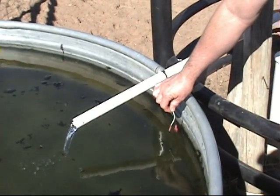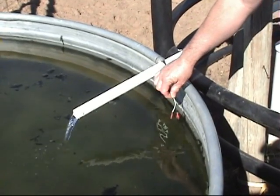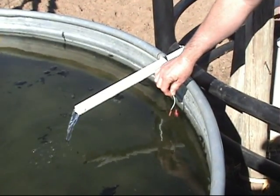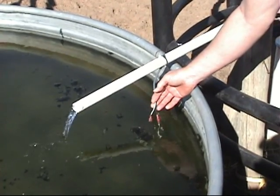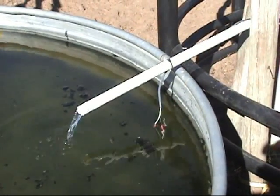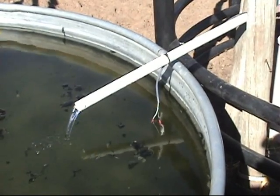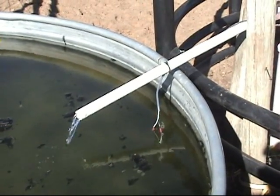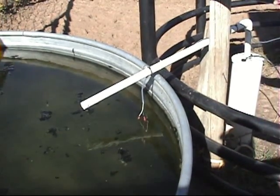Now that the pump is running, we're just going to dip it in and out very quickly to show you what it would be like with waves coming against it. We have the 8 to 10 second delay in place to ensure that waves do not surge the pump off and on. It must maintain connection in the water for a full 8 to 10 seconds, and then it will shut the power off to the pump, as you can see.